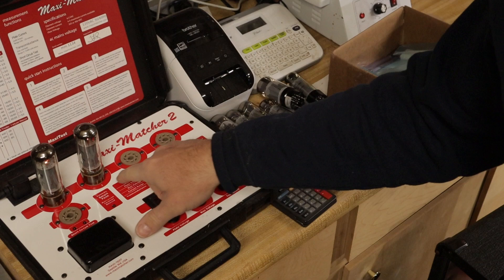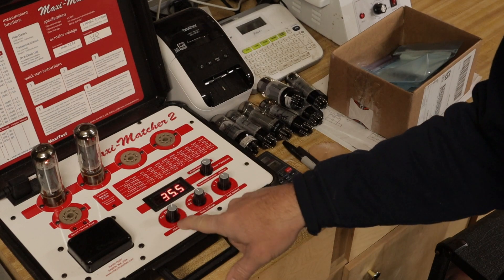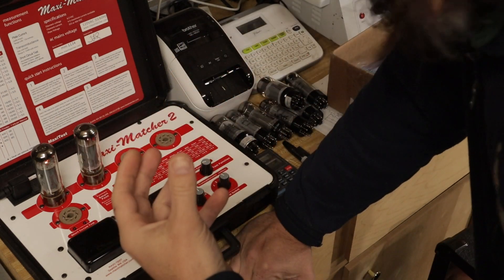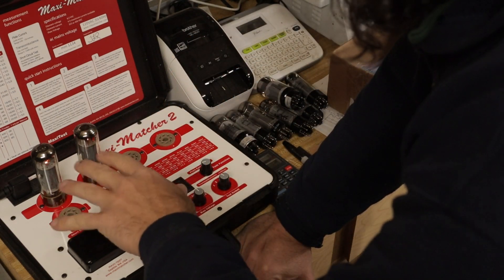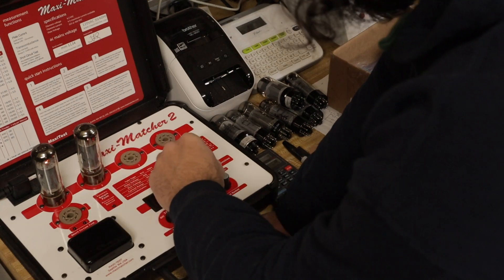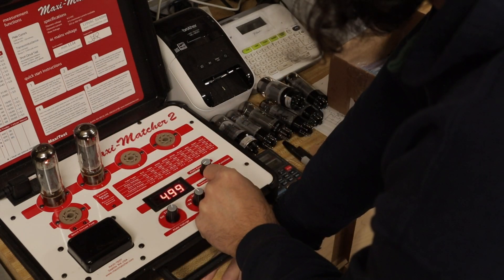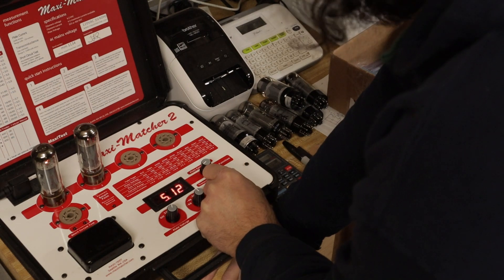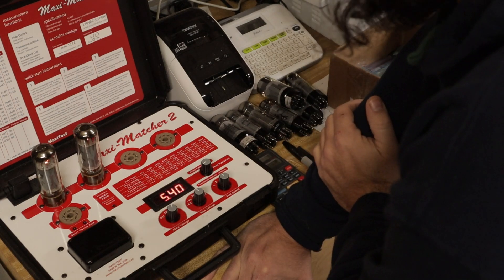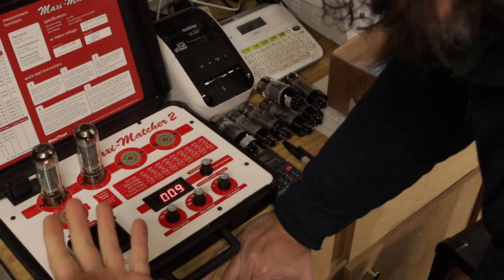So I took the EL34s out of the amp and I put them on the tester. Everything's reading correctly, but once I put plate voltage on there, it did sound kind of funny — usually you can't hear anything, but I did pick up an audible hum out of the two tubes. The plate current for this one is 35.7, the other one's 37.4. Transconductance looks good for both — I'm reading 5.12 and 5.41. A little bit off from each other, but not too bad. So the tubes really should be okay, at least they're testing okay.